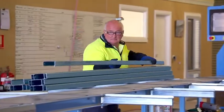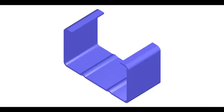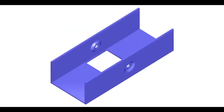Two sections are manufactured: a ribbed C-section giving strength to trusses and studs, and a U-section for nogging and plate. There is also an optional L-section for ceilings.